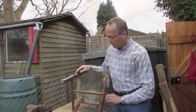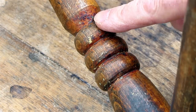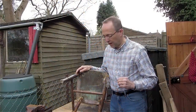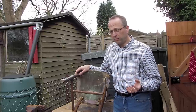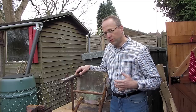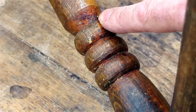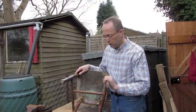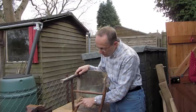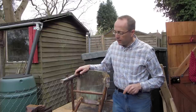The legs are made of beech, and you can see how in earlier days it had been coloured red — probably to make it look like mahogany. Nowadays we might regard beech as quite nice quality wood, but back in Victorian times people would rather look down on beech and want to dress it up. There's evidence of a treacly type stain-varnish where the chair would have been dipped into a big tank and coated in a lacquer giving it a red hue, which has been retained between the turnings where the blow-lamping and stripping hasn't fully removed it.